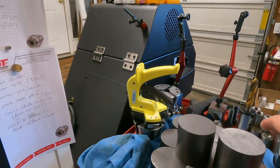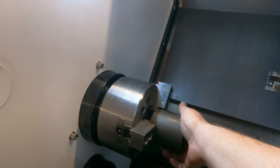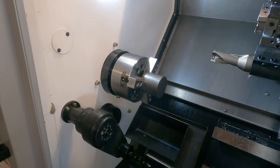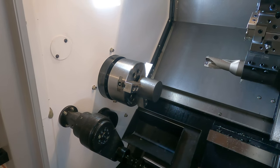Start with a piece of stock. Come into our three-jaw chuck. We've bored the jaws on the three-jaw chuck to hold that. It's three-inch stock, cut approximately 2-7/8 inches long.